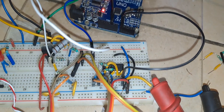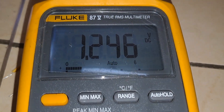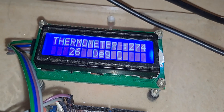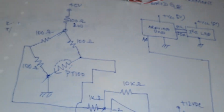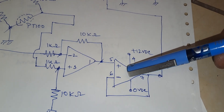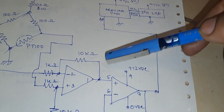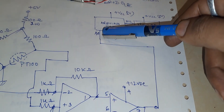You can see here the output of the op-amp is shown on the multimeter — 1.2 volts — and I am reading presently 25 degree centigrade, which is my room temperature. Whenever I apply heat to this sensor, the bridge becomes unbalanced, the signal is amplified, and fed to the unity gain buffer to match the impedance of the Arduino Uno with the op-amp. Then after the buffer it is fed to the Arduino Uno.